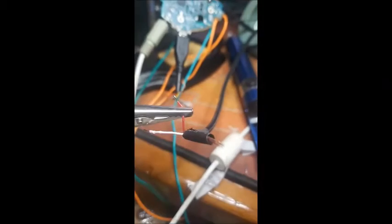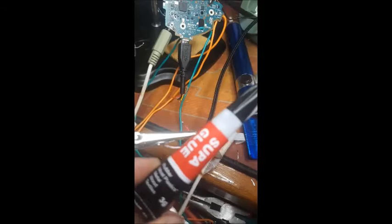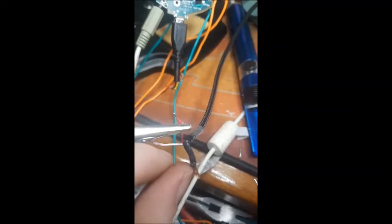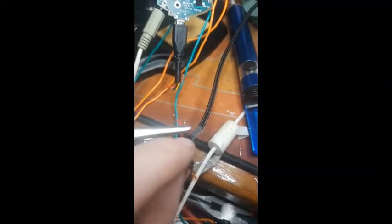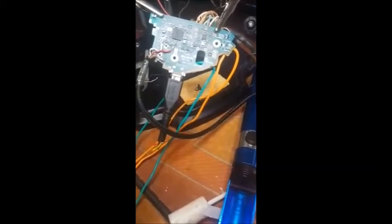I've got the left, right, and ground leads - the ground is actually working as the sheath as well. Just putting a bit of heat shrink on there so they're all the same length and won't short anything out when soldered onto the board. Used some super glue because the heat shrink didn't go quite far enough - just a dab at the end so it won't go back and forth. The headphone jack wire is in there with some extra, but it'll all look good once tidied up.